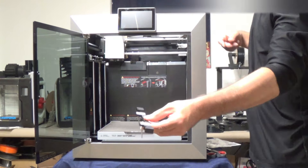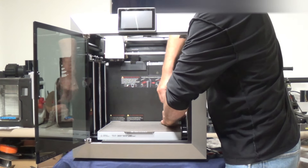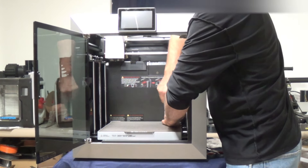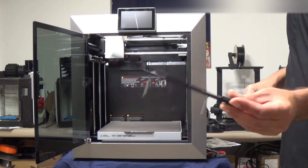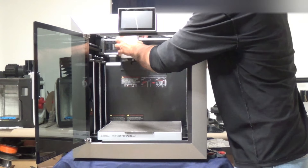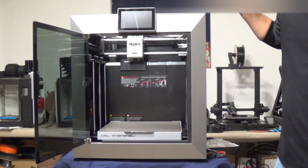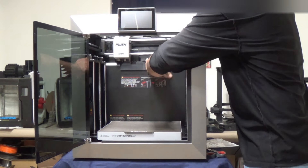Let's move over to the near side and remove the two screws over here. We've got both of our pull-down plates out of there — those were connecting the bed down to the bottom. Now we've got one zip tie up here going around the cardboard box they have around the print head; we're going to go ahead and cut that zip tie. Pull that out of there — looks like we can now move the print head and get the cardboard piece surrounding it. Wow, that's a big print head.